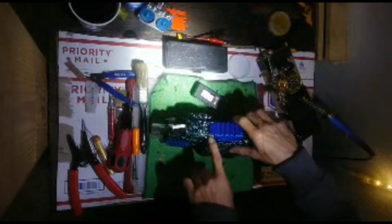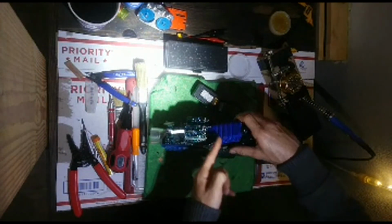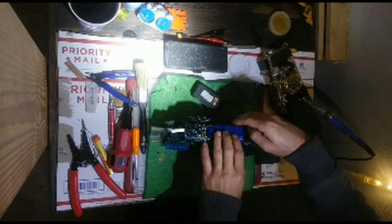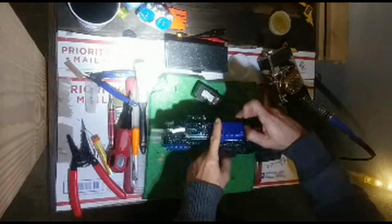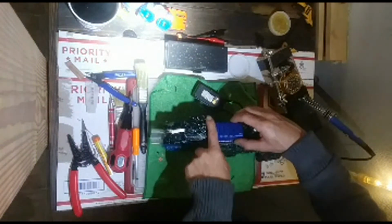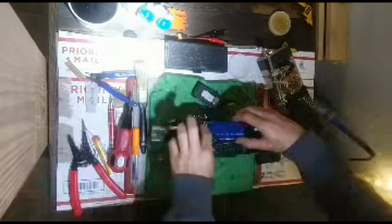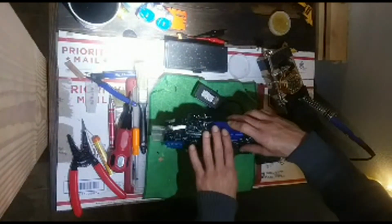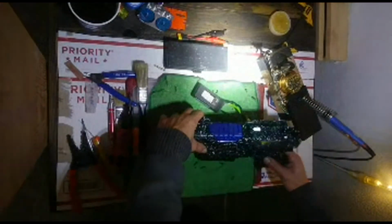Also, want to be careful up in here because there's a metal pin that runs. This is the dart jam clearing door. You pop this open to clear out any jams. That metal rod, if it's not lined up with the two holes in the post inside of the shell, they can crack and lead to all kinds of misalignment. So be careful up here. Okay.